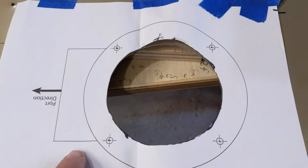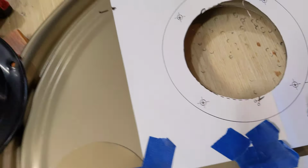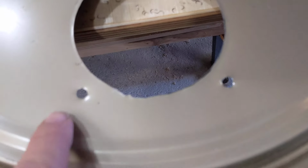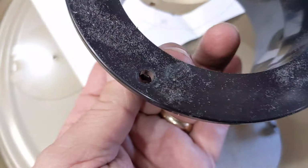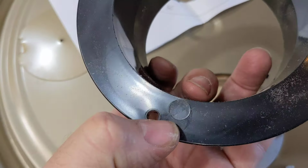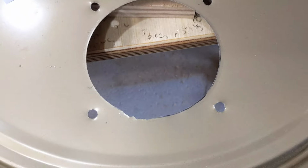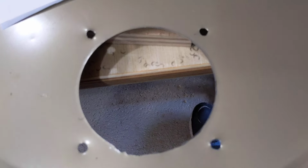In my case, metal top. I used a little punch, an awl actually. It's thin metal, so I used that to set these holes, and then I drilled those out. I forget what size I used on that. Figure it out. Do something a little bit bigger than this. So whatever fits through this, go up a size or two, because give yourself a tiny bit of wiggle room. Otherwise, I usually end up doing it 2 or 3 times when I attempt to do it perfect.